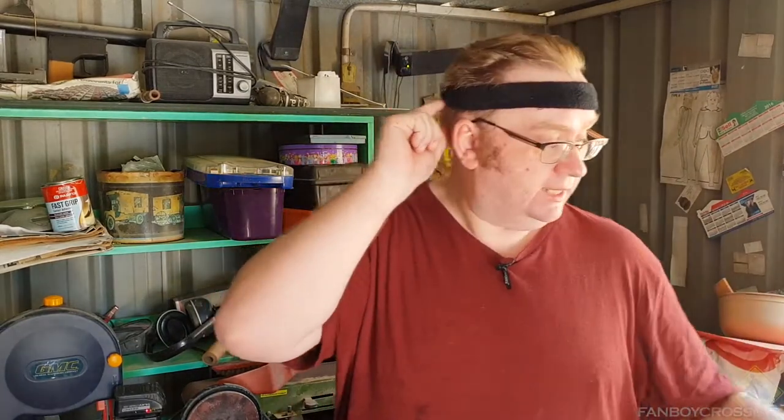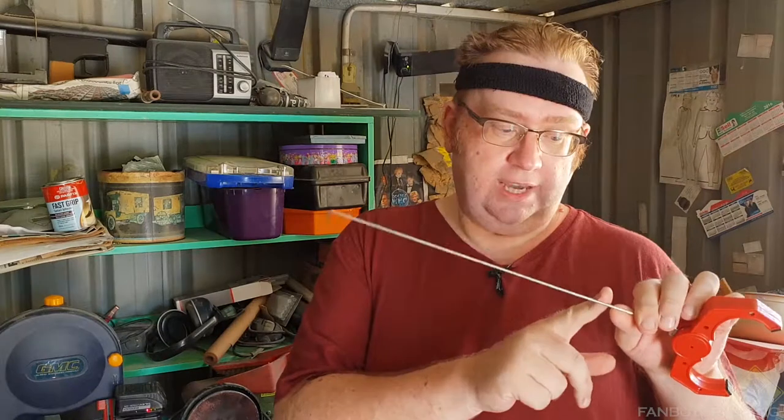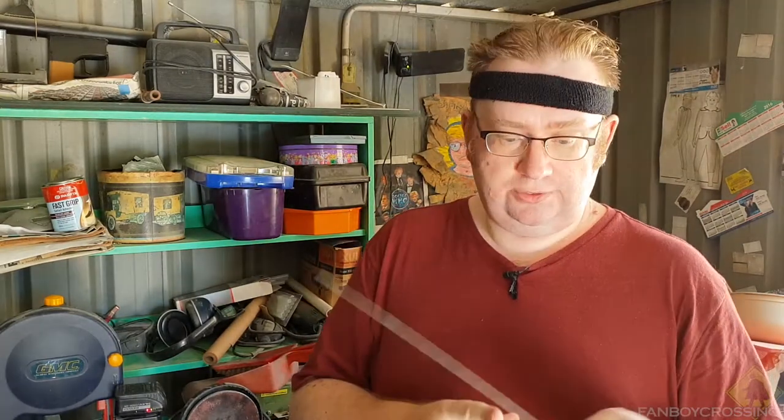I can not worry too much about screwing this one up. And as I said, these are cheap enough that I can buy another couple. Push comes to shove, I screw up one, I can order another one and work on this one. So steps to take: mark this, set up the drill, drill it all out, then set up the bandsaw, cut it out, mark that down, bend it, cut the excess off, then reassemble.